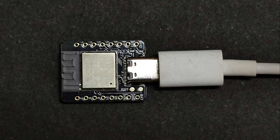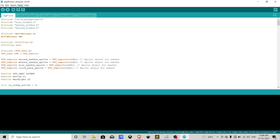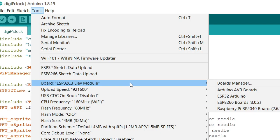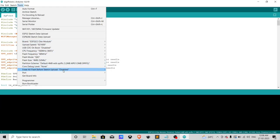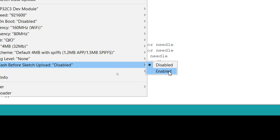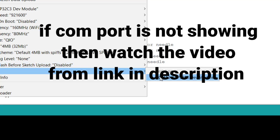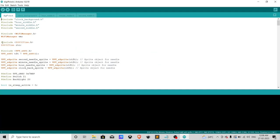Now connect the ESP32-C3 with your PC. Now go to Tools and select the ESP32-C3 board. Now below select the port. If your port is not showing here, watch the video linked in the description where I have solved this problem. Now click on the upload.